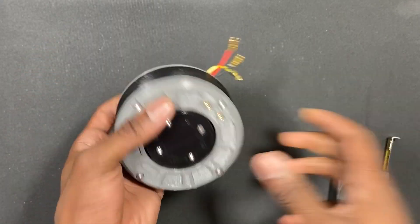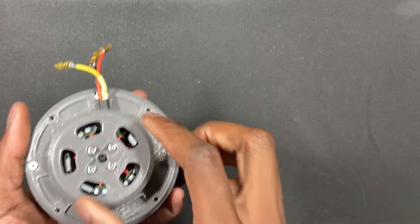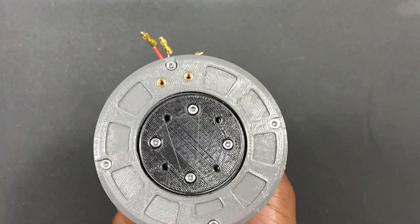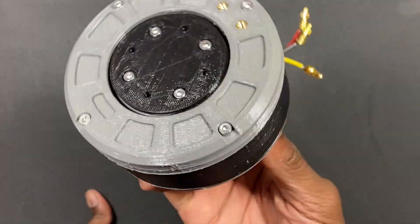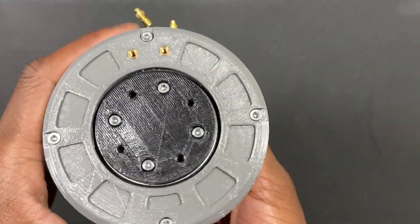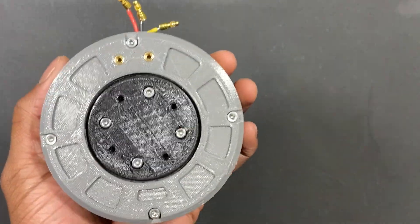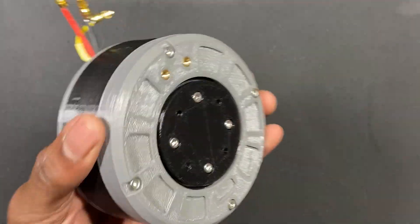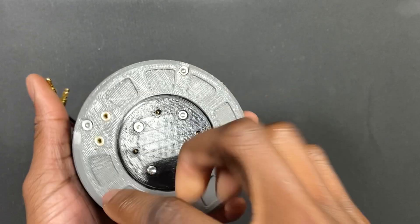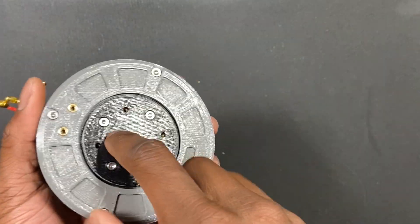It's fairly small compared to my other actuator designs, which I'll show next. The motor is down here, and then we have all the gear stuff here. We have a deep groove ball bearing in there that drives the output shaft, and I'm just using M3 machine screws — four on top and bottom, and four in the middle to hold the output shaft.